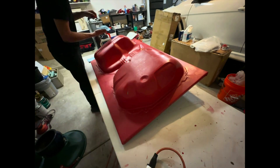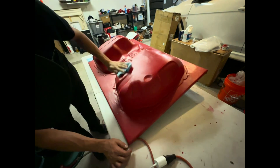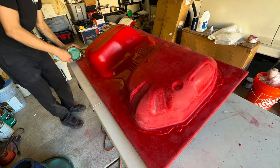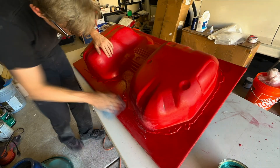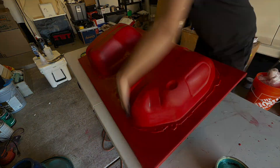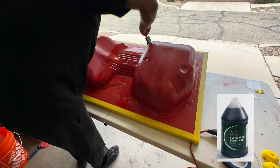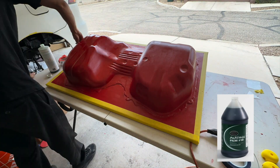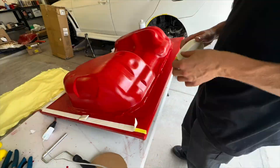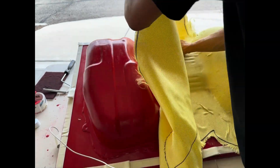Next was to apply seven layers of mold release wax. I really took my time as I wanted to have this part come out as clean as possible, so maybe went a little overkill on the wax but in the end it turned out. The very last step before laying fabric is a PVA mold release — I just used a foam brush to apply a few coats of that. Next I put down the gum tape that will eventually seal the vacuum bagging to the part itself.